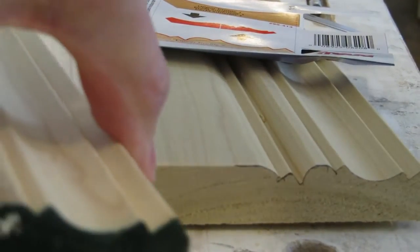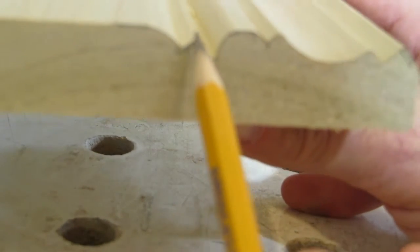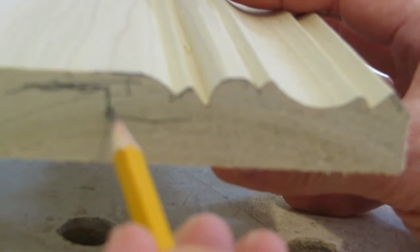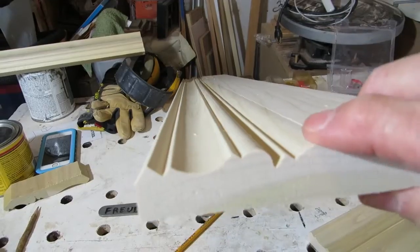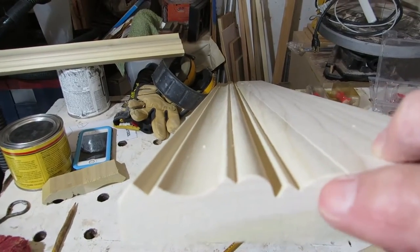I'm running my pieces through — that's the main piece, here's the test one. What I'm trying to do is, as you can see in their picture, achieve that specific curvature on the bit. The board will remain flat and I'll cut the other side with the outer bit. I want to walk up on that profile to where this curvature is flush or smooth — or maybe slightly stepped down — and when I use the other outer bit, it'll round over to that and you'll have a flush surface. Once I can see that little line there, I know I've got the full profile of that bit on the board, and that's where I'll stop cutting.